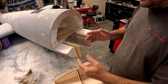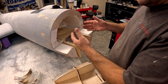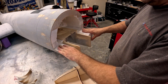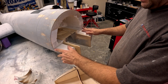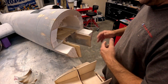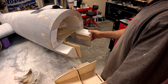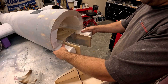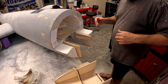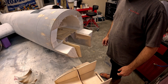I'm going to mix up 30-minute epoxy and just put a huge glob of it on the outside so it can run down, and do the same on the inside of the new walls. Everywhere else will get gorilla glue, then it will get tack-glued with some CA in a couple places to help hold it in position, and then we'll use some HVAC tape to hold everything nice and tight up against where it needs to be while it cures. That's the plan — now let's get to working.